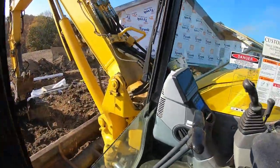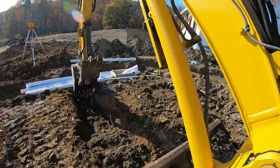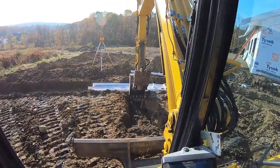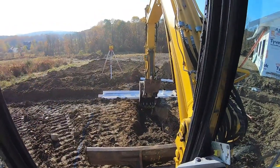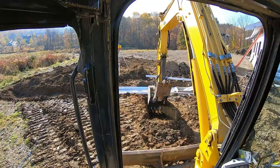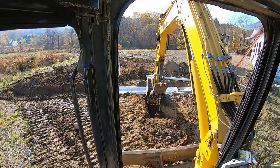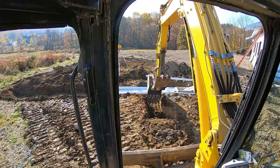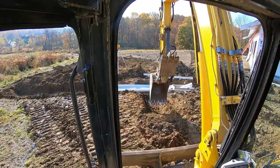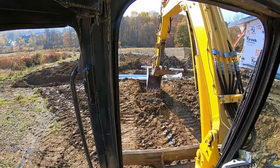So on the second lead, we're taking the dirt from there, putting it in on top of that one. Make sure you're 6 inches down from your trunk each pull, so you're 6 inches right off that trunk. Laser set to that height, we're ready to go. Right there. All right. That should work. That will give us 6 inch for our stone. Then your stone's always even with your trunk because your pipe's coming off even. So remember that's how important that trunk is to lay out and rake it out by hand. Make sure you get it right. Get these lines nice and straight.